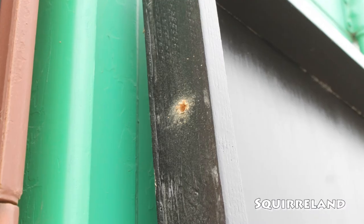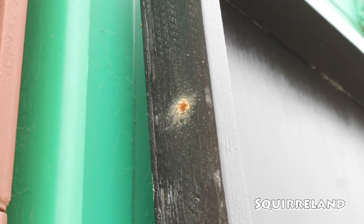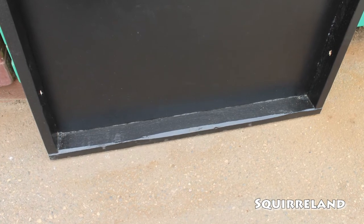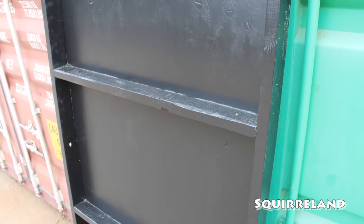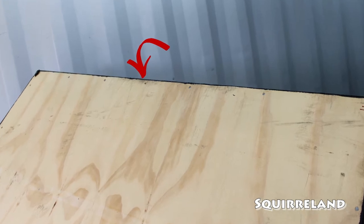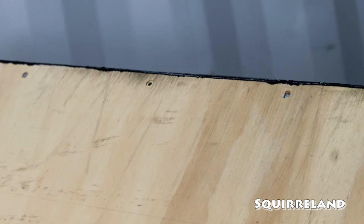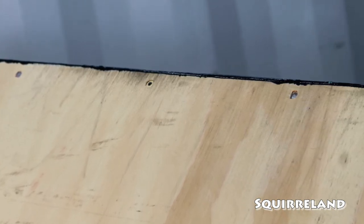To help them assemble the walls correctly, I built some visual cues into the panels to indicate what is up and down. This is what the beveled piece of wood is for from earlier. If the bevel isn't facing up, that means that the panel is upside down. The screw in the middle of the panel from earlier is the visual indicator from the front. All someone has to do is find the end with the middle screw, and that means that end is the top. If the panel is decorated and the screw gets covered up, I usually build some kind of other visual cue into the decoration on the front to indicate what is up or down.